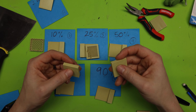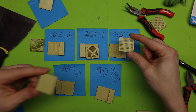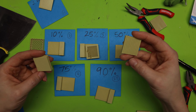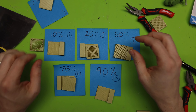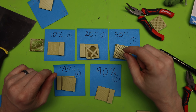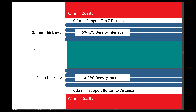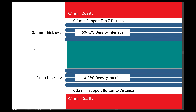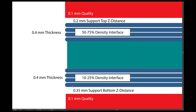The only issue between 50% and 75% is that 50% came off very easily, but 75% was a little harder to get off. Looking at the comparisons, you cannot tell a difference in print quality. When it comes to your interface, you want a high enough density so your model can print to it, but without sticking. I would say anywhere between 50% and 75% would be a perfect range for me.